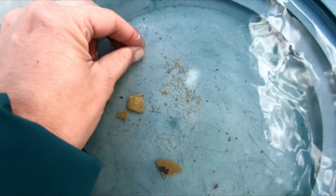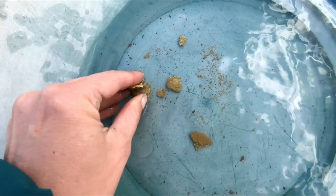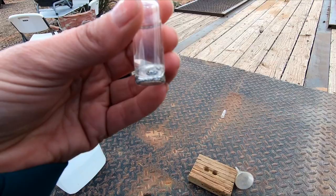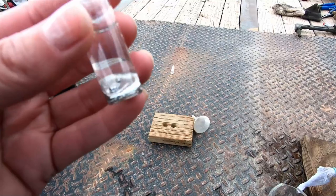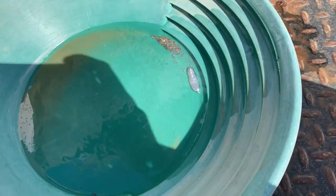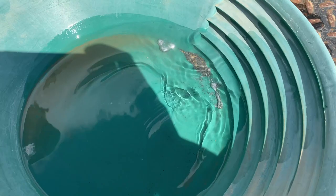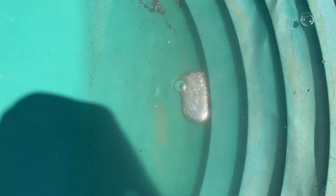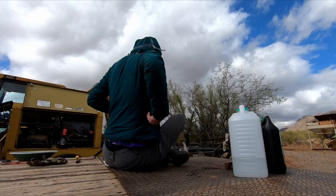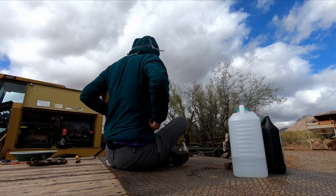You have to use a lot of graphite in the vapor chamber to make sure that the gold is going to fall out. We took the mercury from the first run out of the cup and put it into this little vial. For some reason, the mercury is not wanting to stick together or become a combined liquid, and there's graphite floating on top of it. So we decided to give it a gold test to see if the liquid mercury we just extracted from the retort would actually pick up gold. There's a little bit of a problem — the gold only wanted to stay on the outer surface of the mercury. The mercury wasn't really absorbing it or pulling it into the structure. I researched this after the fact: if I would have added a little bit of lye into the graphite when we vaporized it, the mercury would have been clean of graphite.